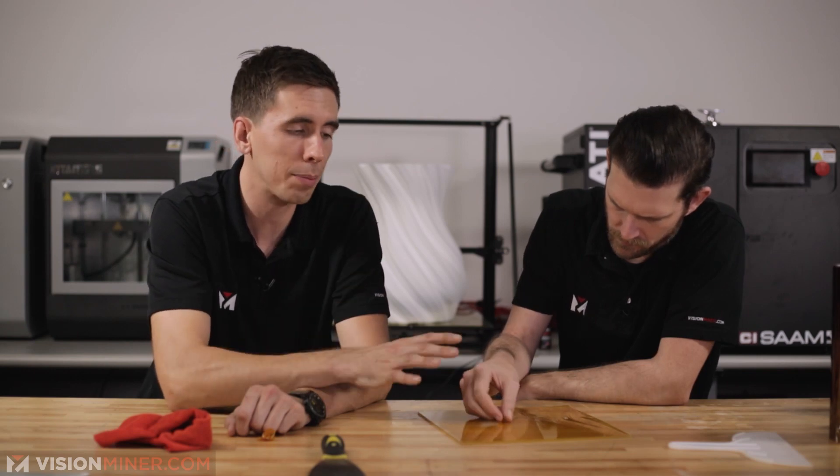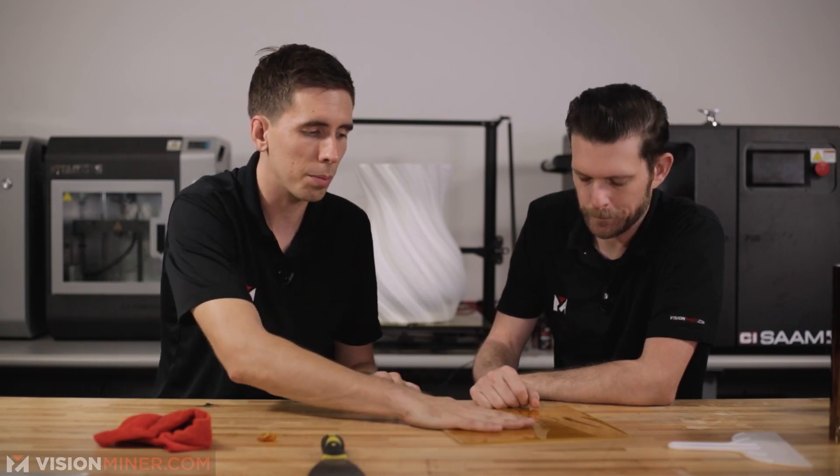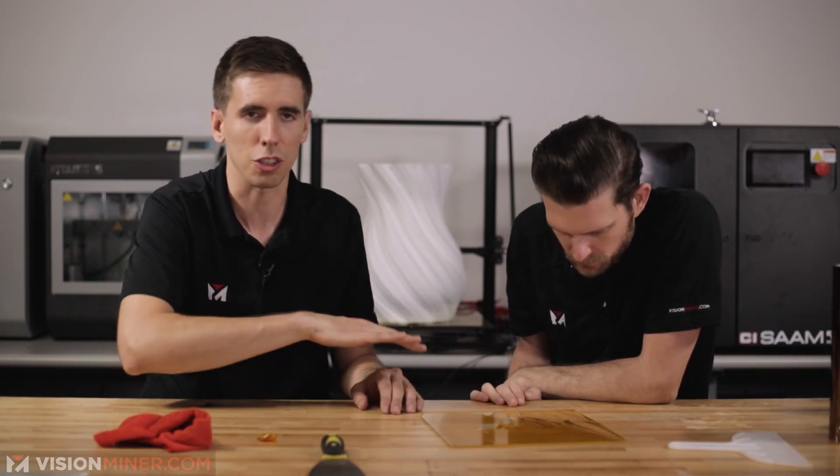It's important to note that Kapton tape won't actually work for high-temperature materials like PEEK, Ultem (which is PEI), PPSU, or any of those. It'll just rip, kind of like blue tape rips with ABS. It has a lot to do with the heat — the temperature of the build plate causes the adhesive to just stop sticking and peel up. Plus, the warping on those materials is so much more intense that it just doesn't stay down.